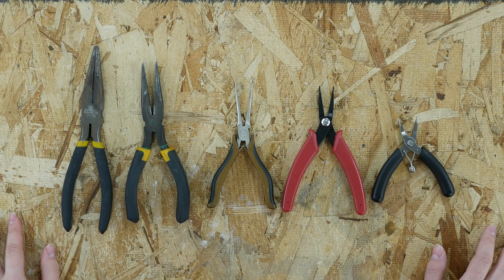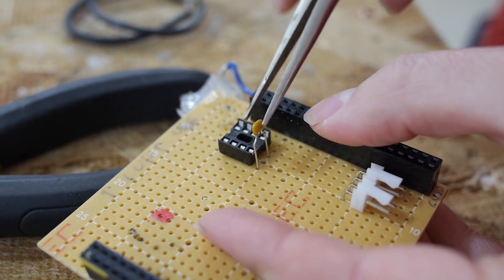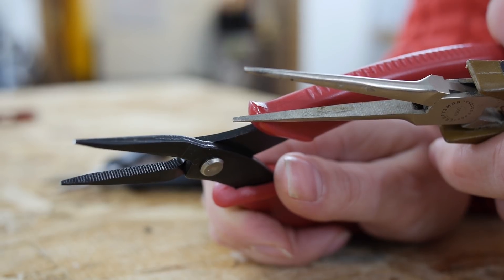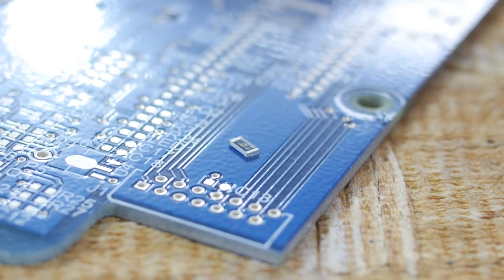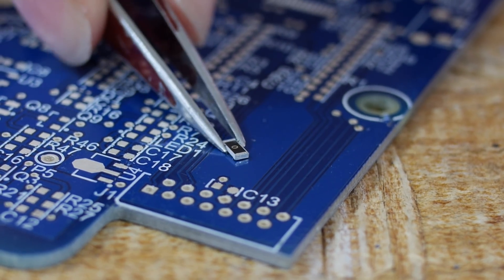Here are some examples of different types of needle nose pliers. For doing electronics work, small and narrow pliers work best — they allow you to get into tight spots in circuits and make it easier to manipulate parts and wire. Some are smooth on the inside and some have teeth; if you have a heavier duty task like bending thick wire, the toothed ones are better as they grip better and give you more leverage. If using very small components such as surface mount components, you may decide to use tweezers for a more precise grip, however needle nose pliers will give you a stronger and more secure grip on those same parts.